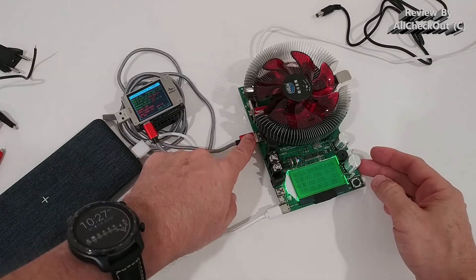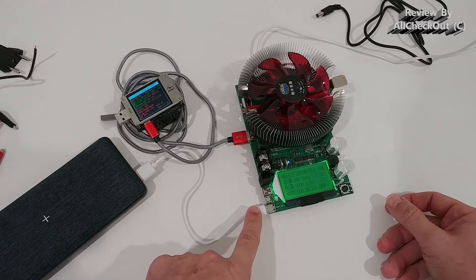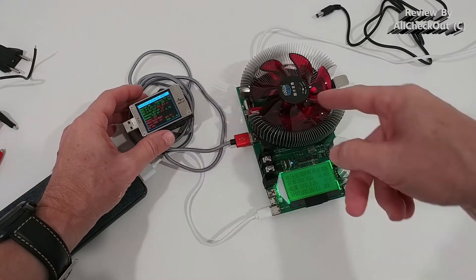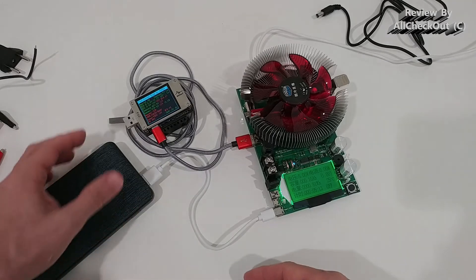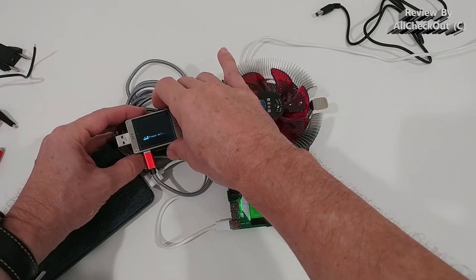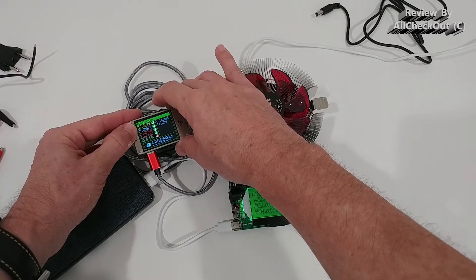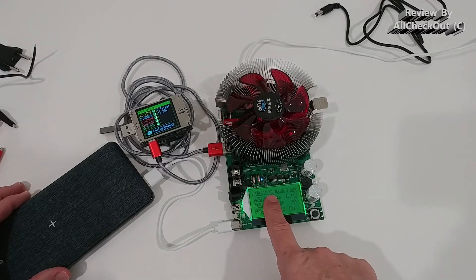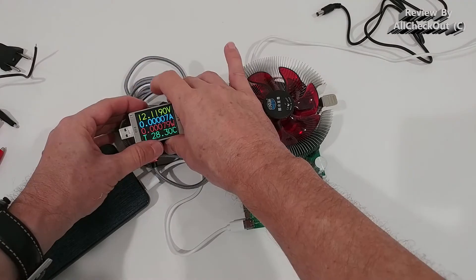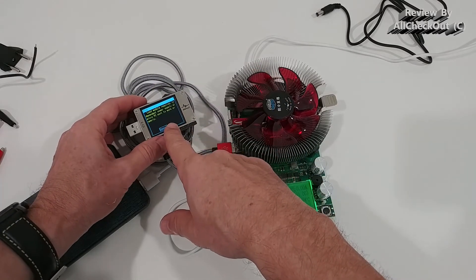One more thing regarding USB: they mention Quick Charge. This USB-A port here is actually an output — the power comes from the power bank, goes into the tester, and comes out here so we can test Quick Charge 2.0 and 3.0. But of course it's not from this device — it's testing the connected device. We can work with higher voltage. That's Quick Charge 3.0 triggering, and we can increase the voltage. We're now at 12 volts — confirmed 12 volts, but that's coming from the power bank, not this device.